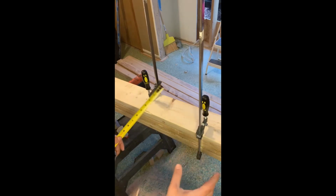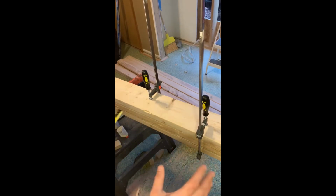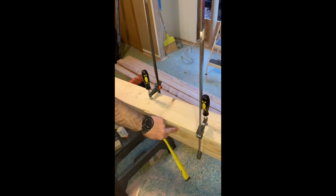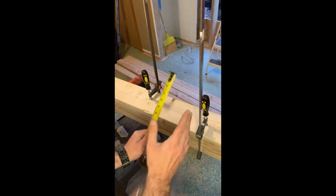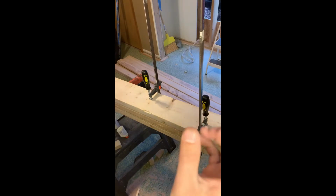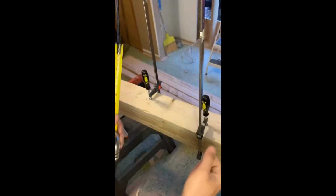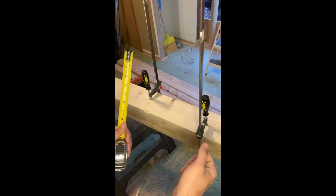So I was using a little bit bigger OSB than I thought I had. So we're actually there. We didn't need to use all 4 pieces. So we used the 3. We went solid board, 2 pieces of OSB glued in between, solid board. Now we have our 5.5 inches that will be put up as our header. That'll make it very strong, so that our wall won't fall down or our roof won't fall down.